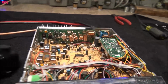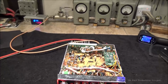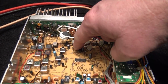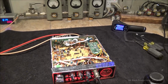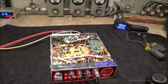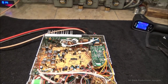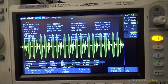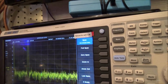Alright. Well, this one didn't exhibit the same heating issues as the other radio. We went ahead and reattached the mod limiter. Somebody had cut this resistor here. I'm not a fan of cutting resistors or pulling limiters, or just not a fan of it at all. Went ahead and cleaned up the coils and retightened them all back together. Not too bad. And we're 100 kcs wide.